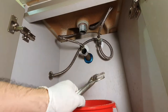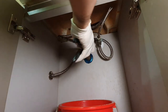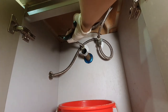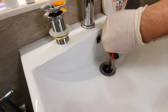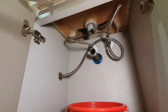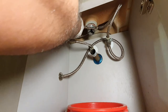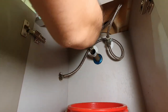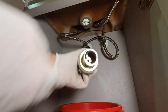This has to be changed, so we'll put it aside and grab our channel wrenches at the largest setting. We're gonna give the nut attached to the bottom of the sink quite a good grip. I'm using a pair of long nose pliers to hold on to the top of the sink while I turn the bottom nut — this is to prevent the stem from rotating as I'm turning. Once you have the drain removed, do a bit of cleaning to get rid of all the scum at the drain hole.